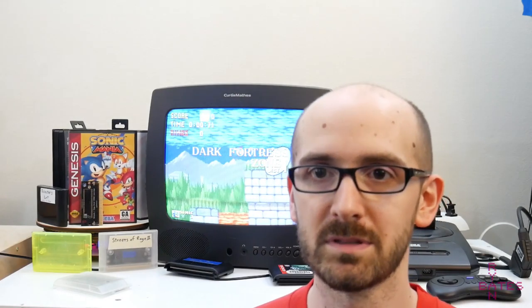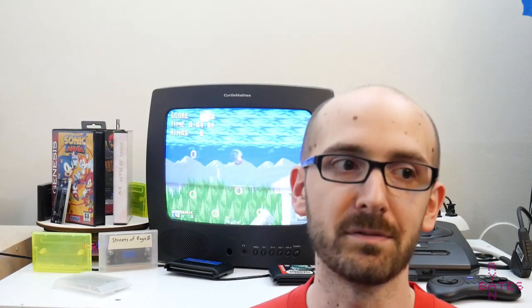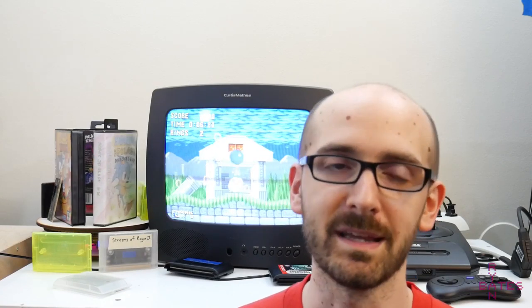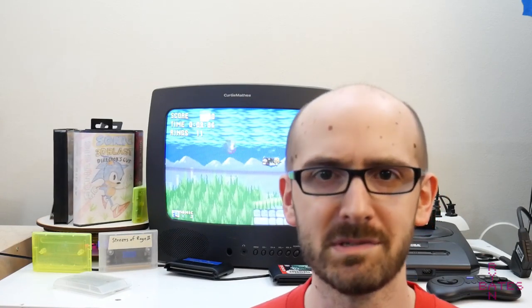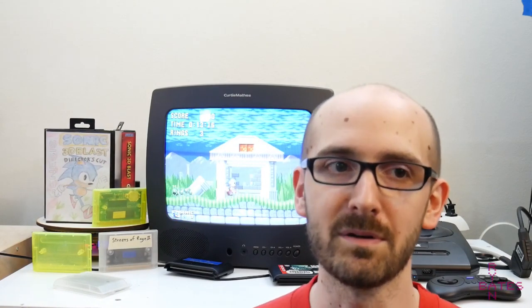If you've ever been in the design or R&D phase, which this whole thing felt like, you might want to put sockets on every single chip that you're not willing to sacrifice. Some of these chips, like the SRAM, are $2.75 each, and it's hard to commit to soldering an entire PCB not knowing it will work.